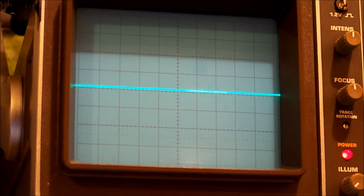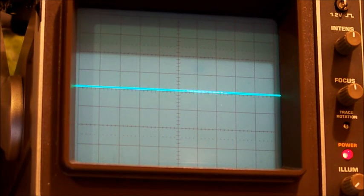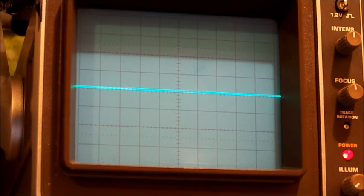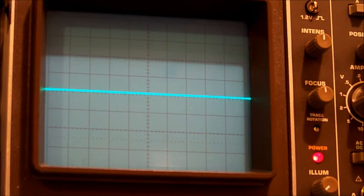There, yeah, okay, so pin 1 off the bat has a... It's AC coupled. Pin 2, pin 3. Okay, I just ran down those inputs and there doesn't seem to be anything. Pin 26 should be our serial data, so I guess we should see if there's any activity happening on there as well. We have a look at 28, 27, and 26.